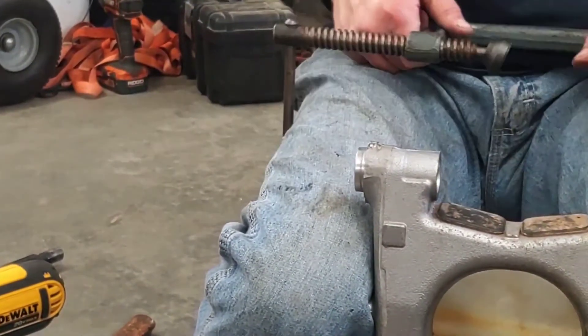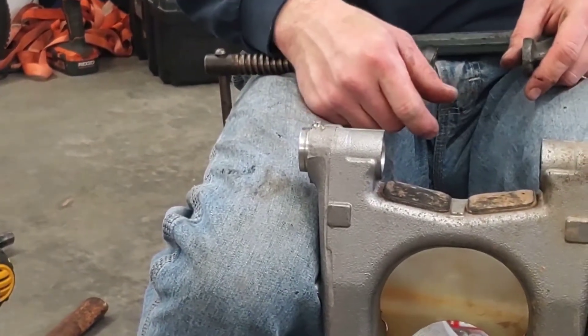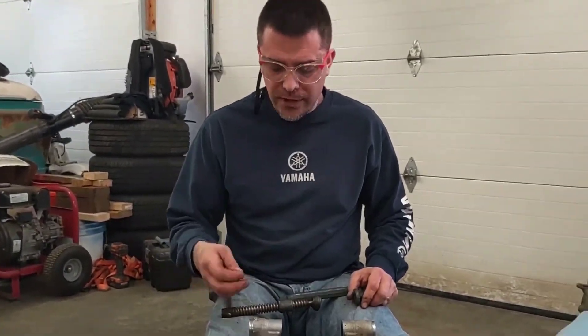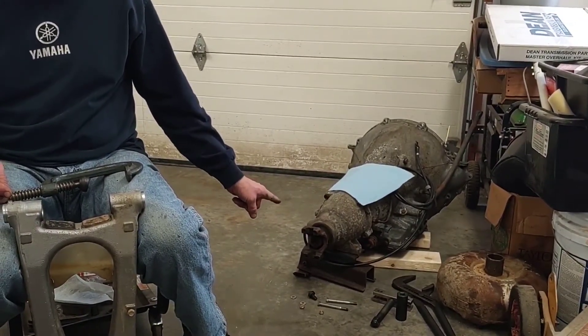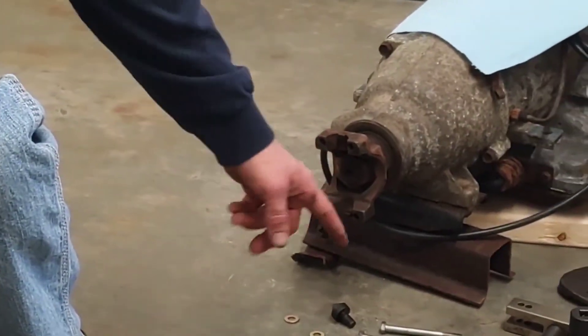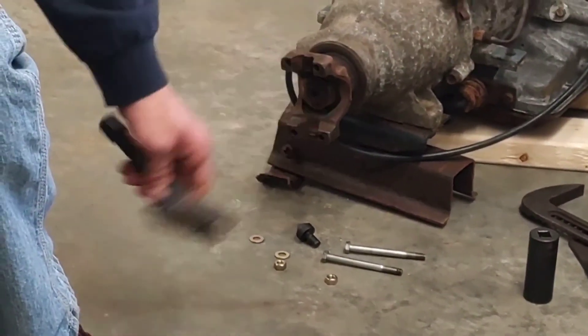Basically the procedure is going to be the same on this side — I'm going to put a little bit of grease on here, put my seal in place, and then I'm going to reinstall it into the machine. So hopefully you enjoyed our little lesson on driving out bearings and driving new ones in. Kind of a simple lesson, but if you've never seen any of these tools in use before, kind of a valuable one. Hopefully you enjoyed it more than I did because I really hate being on camera. Stay tuned because I bought a transmission for one of my trucks and I think I'm going to tear that apart on camera too. Later on I'm going to go and get a socket big enough to fit this from my father's house, and I'm going to show you how to use a puller to pull this yoke off.